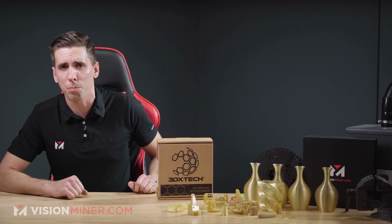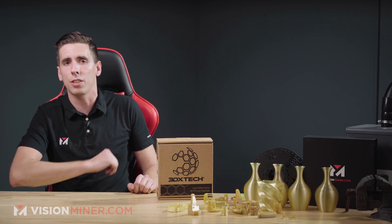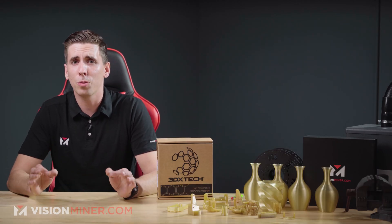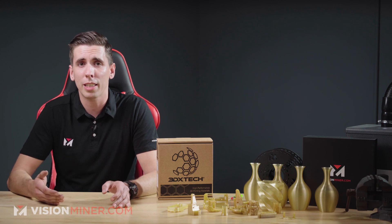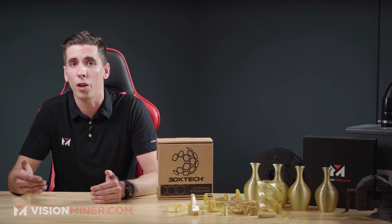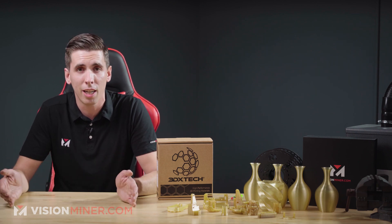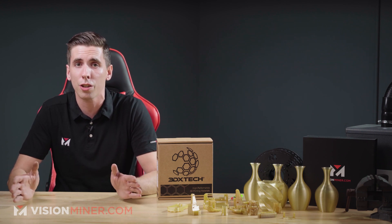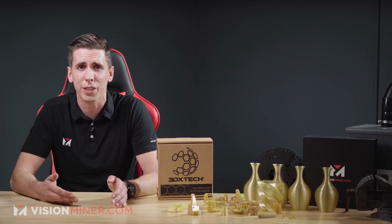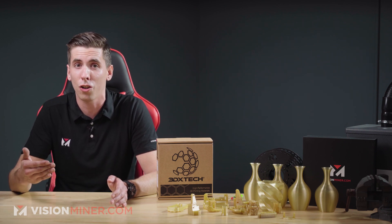Let's talk about some specific environmental factors. For UV-heavy applications, it's very, very stable — if you're putting it outdoors in the sun for years, rest easy, it will survive. As far as hydrolytic resistance goes, Ultem 1010 does not absorb a lot of moisture after printing and it doesn't break down when it comes in contact with water, so you can actually use this filament underwater. As far as chemical resistance goes, it handles chlorine, sulfuric acid, and hydrochloric acid — all good.